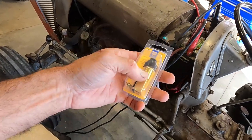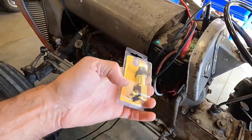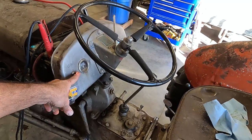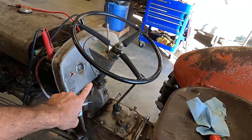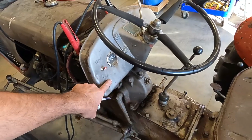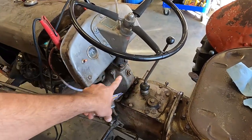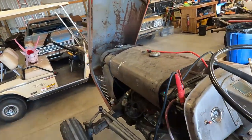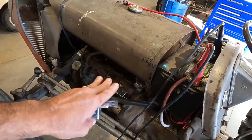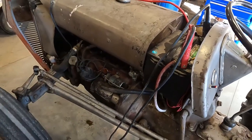We're going to wire this up, battery 12 volts on one side, the other side's going to go to the positive side of the coil, and then you'll turn your ignition on and push it, kind of like an ether button almost. We'll push the button as we manipulate the start switch, and it should make fire really well. And then as soon as we let off the button, it'll just go back to the regulated 9-10ish volts, so the coil won't get overheated as it just runs. Should be a simple fix.